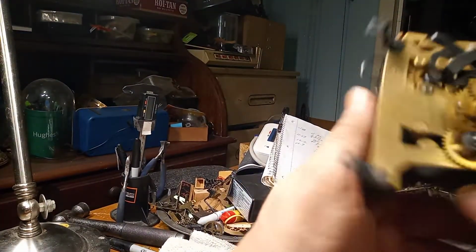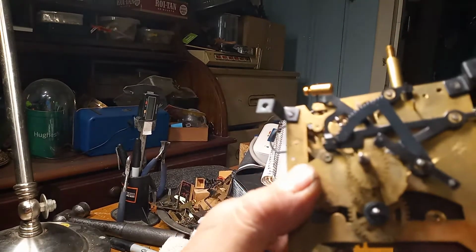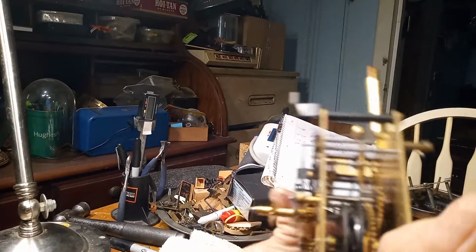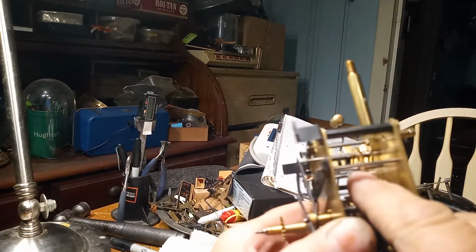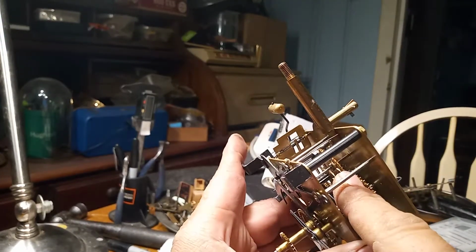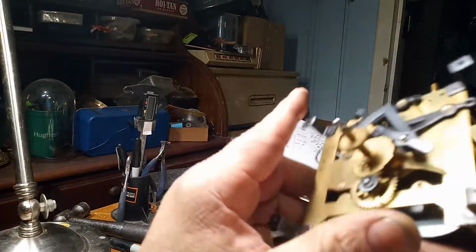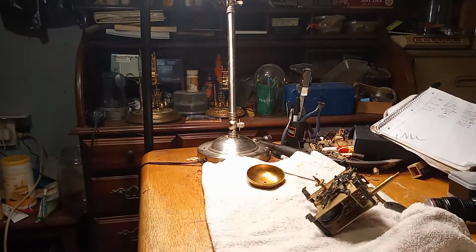I don't see any pivot wear that would stop this clock from functioning. It looks like an 8-day clock to me because there's a great wheel, a second wheel, a third wheel down here, and the escape wheel. So it's an 8-day clock. So let's get to taking this thing apart in the next video.